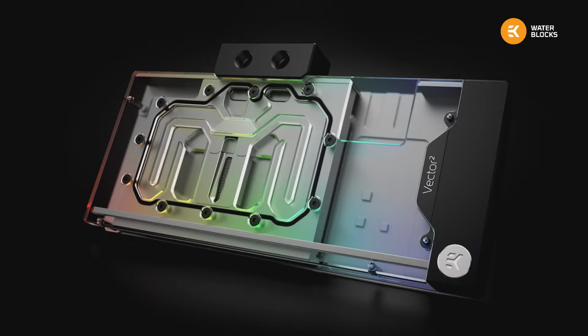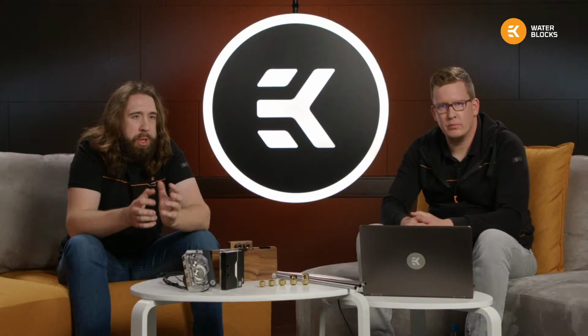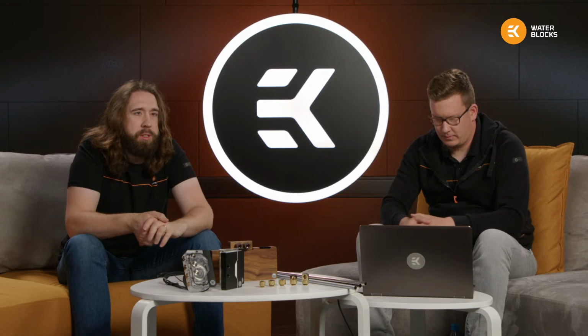So the speed of the coolant entering each fin is controlled, and we can have a much more even spread from the first fin to the last fin, because if you have a parallel passage, then the last fins inherently get much more flow than the first ones. So this is a great chance to balance that out, and it also means the jet plate is permanently in place, machined into the same piece, and there will be no surfaces in which there is plexi against plexi for coolant to get stuck and stuff like that.